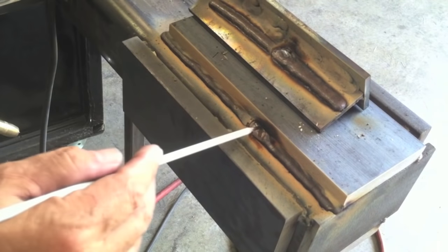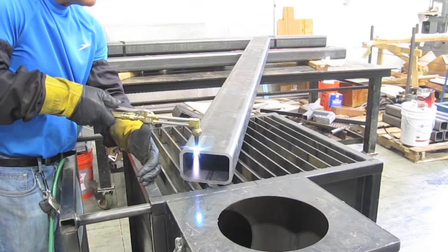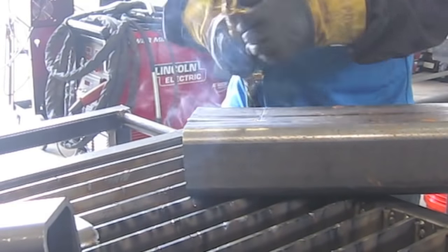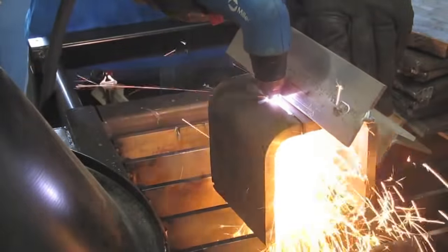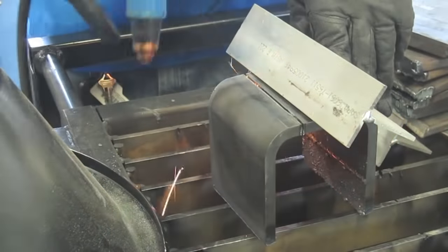Also built a bumper from SwagOffRoad.com using nothing but a Buzz Box and 7014 rods — and 6011 for a little bit where I had to weld downhill on the tubing with some gaps. Welding those heavy tow lugs in, cranking that Buzz Box up good and hot with a 1/8 7014. Also did some multi-pass 7018 fillet welds just to test out some MTS machines — some MIG/TIG/stick type inverter machines that some folks sent me for evaluation. Some oxy-fuel cutting techniques as well as tubing notching and plasma cutting tips using a straight edge and a drag tip.